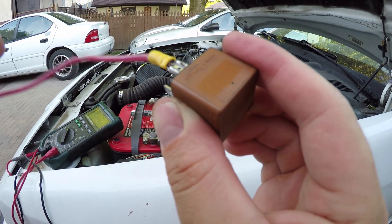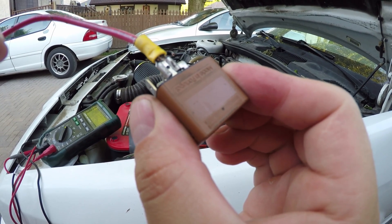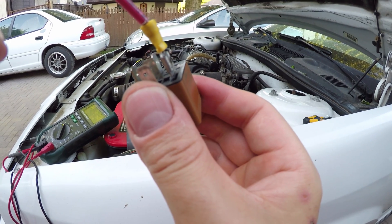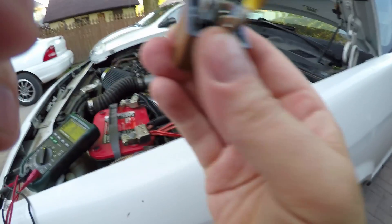It's a high quality Tyco relay and I couldn't figure out why my high beams weren't coming on. I was fairly certain I didn't wire them wrong. I always like to start at the relay with stuff like this because you can pull off the relay and jump the headlight, see if your wiring is good — and that checked out.